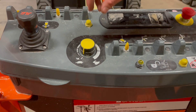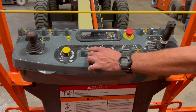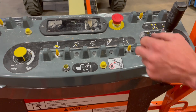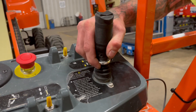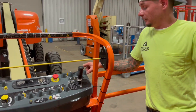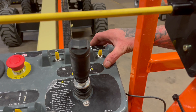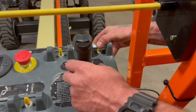This rheostat here — all the way down is turtle mode, all the way up is high — controls your boom speeds only. You also have basket rotate left and right, and extend and retract: bring it toward you to extend the boom out, push it away to retract it back in. Over here on the drive joystick, you'll also have a collar — lift it — this is your forward and reverse, and you always steer off the top rocker. This machine will cut your travel if you get above about 90 degrees, so you just hit the foot pedal and hold your driving orientation toggle switch to keep traveling.